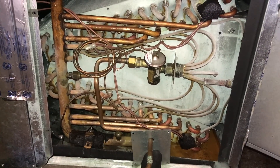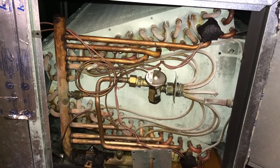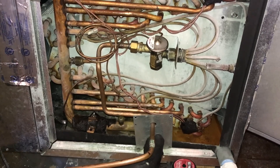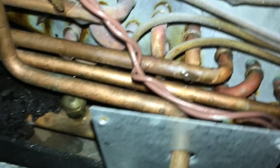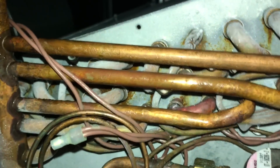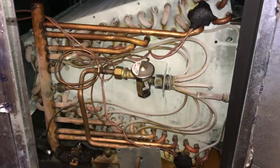They probably had a leak in the coil and they fixed the leak — they didn't think anything of it. Got by a little bit here and there, and now all of a sudden you've got a coil that's not cooling correctly. Look at the very top two — there's barely even any condensation or anything on them, and then the rest of the U-bends are frozen. Thanks for watching — I didn't record any more of this.